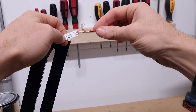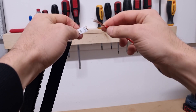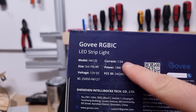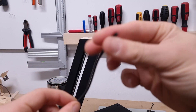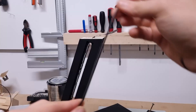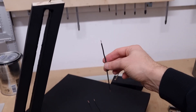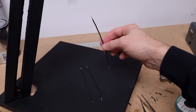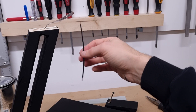Now I'll have to put some copper wire in between this part and the other part — it's going to be hung like this, so I have to solder that on. I thought of using really thin copper wires so you'd almost not see them, but it doesn't feel safe considering there's going to be 1.5 amps, 18 watts, and 12 volts going through it. According to ChatGPT I should have at least one millimeter thick wires, which these are — so it's going to be safer. Unfortunately you're going to see the wire. I have three identical copper wires I'm going to hang between the two LED strips. If you have a suggestion, leave it in the comments below — let us know how you would have tackled this problem of making invisible copper wires to connect the two LED strips without showing them.